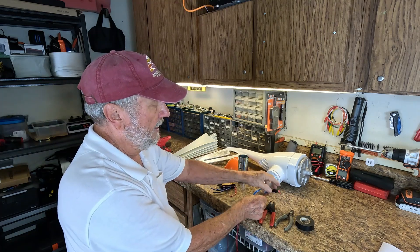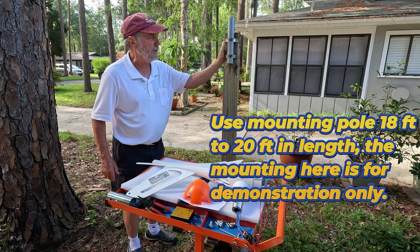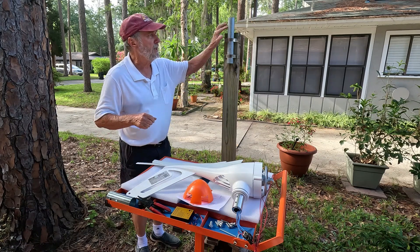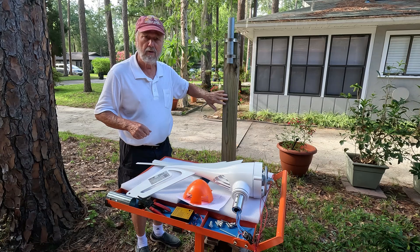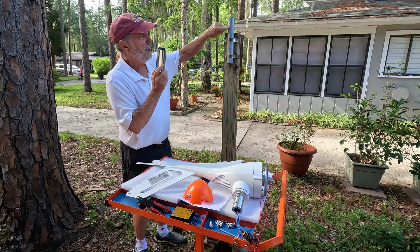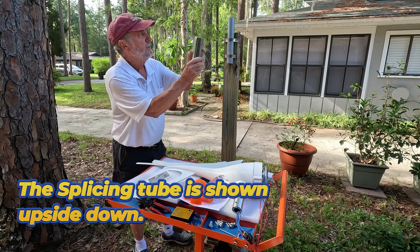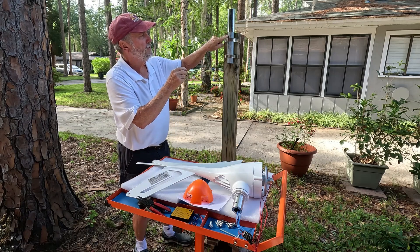You would do all three of them like that. This is our mounting pole, which is mounted to a 4x4 post with some strappings. This could be an 18-foot pole on the side of your house or somewhere in the yard with guy wires. I'm just demonstrating how to connect it to your pole and run the wires, hook up the controller, and assemble the blades. In the pole that I'm going to mount, I've drilled a hole all the way through that I'm going to use for the lower hole of the splicing connector. It only goes one way and it will line up with my pole.